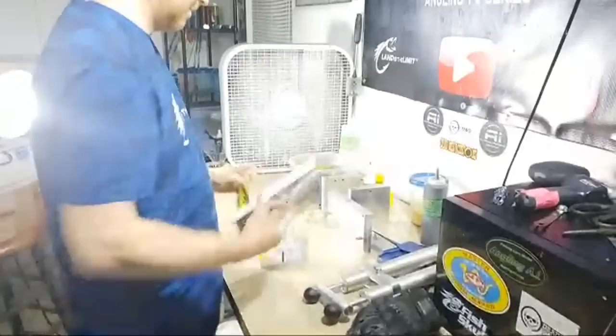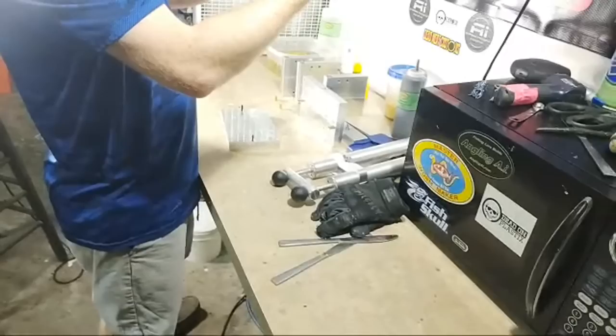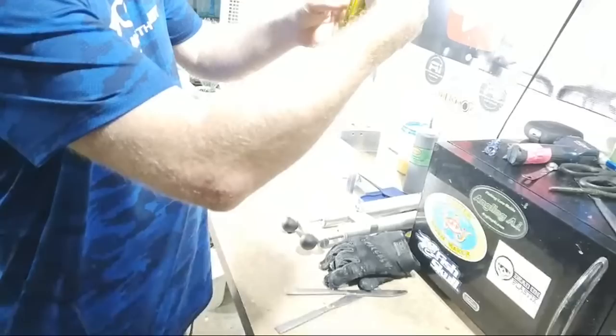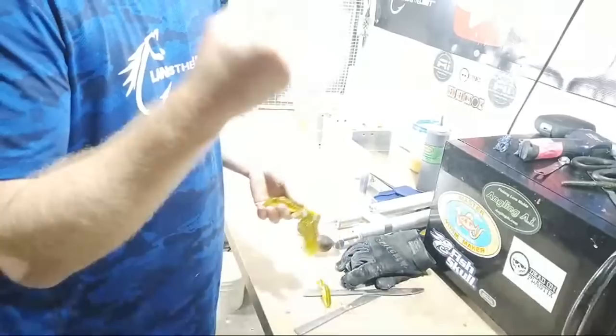What temperature are you shooting your plastics at? I ripped a leg off. I don't usually go above 360. I haven't even used the temp gun on these yet tonight, so to be honest, I don't know. Eventually you get to a point where you can look at the plastic and see the way it's moving in the cup, and you'll just know if it's ready or not. But don't do that if you're starting new. Always get your temp gun and make sure that it's good.